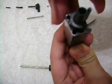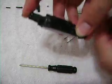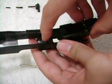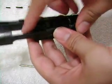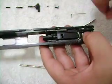You're going to take the two larger springs and put them into the two holes at the top — one goes in here, one goes in here. Keep your thumb there to hold the base plate on and hold this down. Then take your slide — remember those two springs are still going to be sticking out. You're going to have to move it in diagonally, push this way, then push down. It's normal for this part not to snap back all the way. If it does, you lubricated it well; if it doesn't, that's still normal.